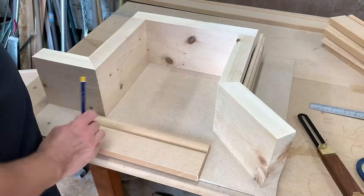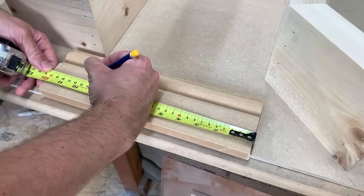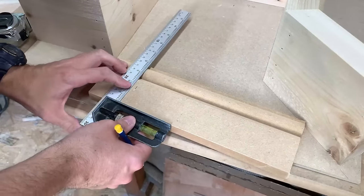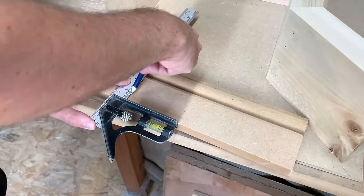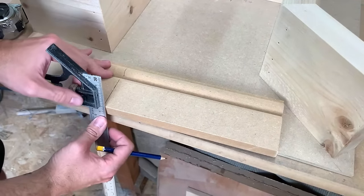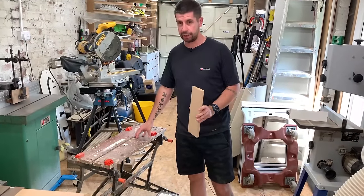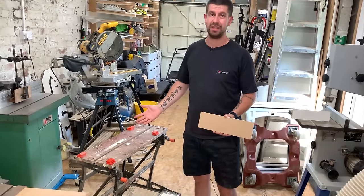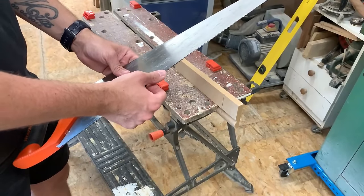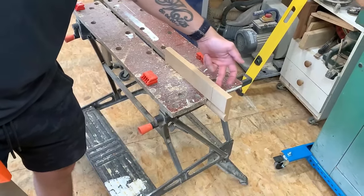The measurement there ended up as 247. I've already got a square in there — get the square and square the line. If you're not too good with your cutting and you need a reference to cut square, I've got a workmate here which just holds the pieces while I cut them. It makes life a lot simpler. On a panel saw it actually cuts on the push stroke, so you always want to cut from the face side so all the tear out is on the back side.